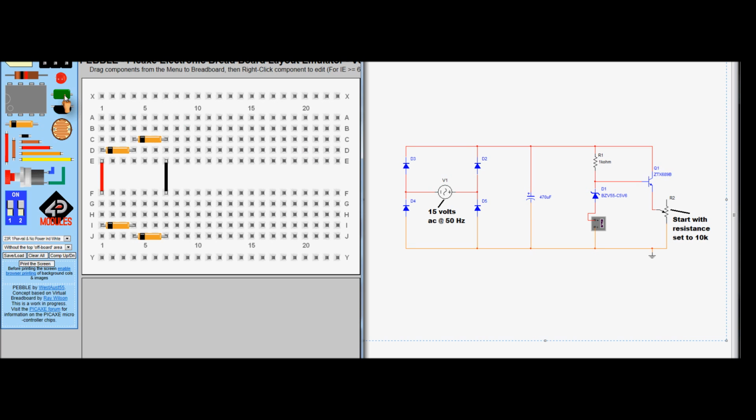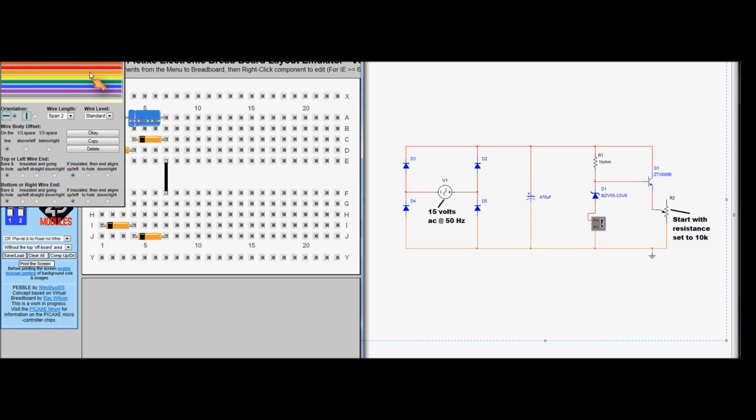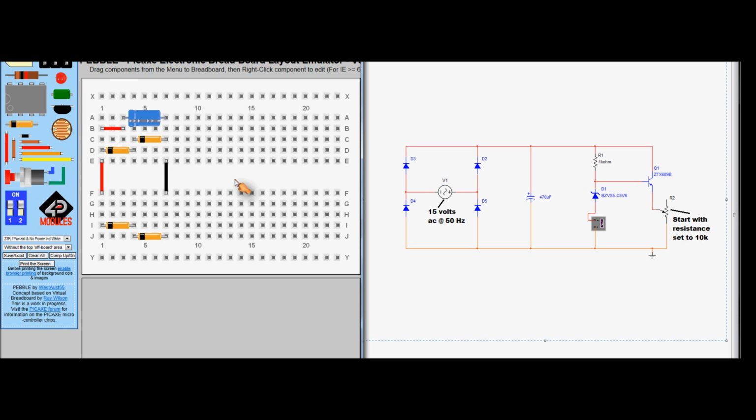This is the template for capacitor. Drag it into your circuit, double click it, select electrolytic and a large size, and we've got it connected to ground here. The negative points to ground, but we need to connect the positive to the power rail, so we'll need a short wire to do that. Double click and change its colour. And that is all of this part of the circuit completed now.